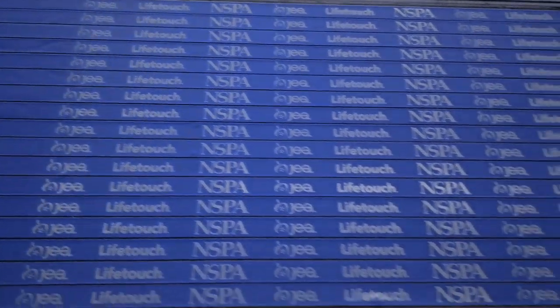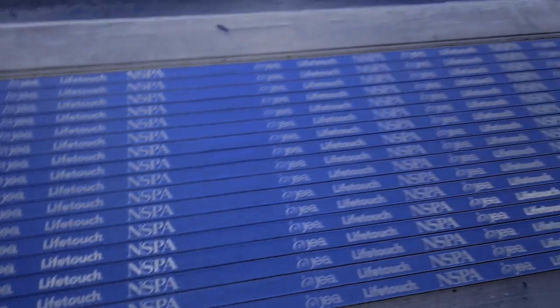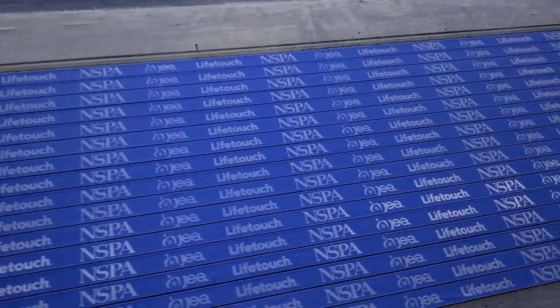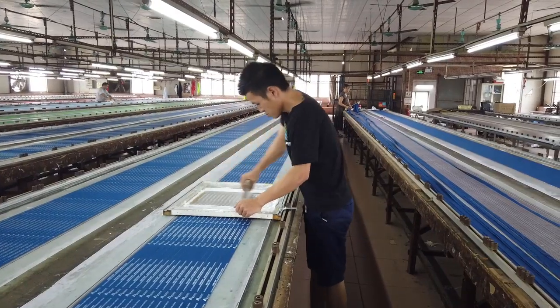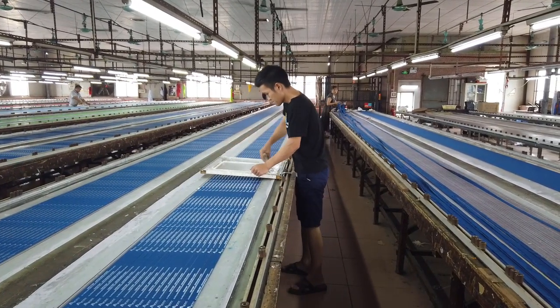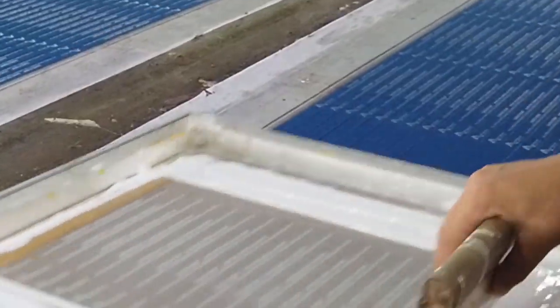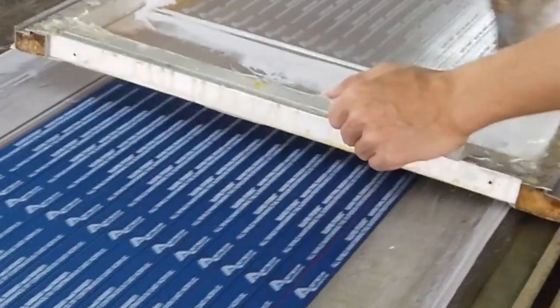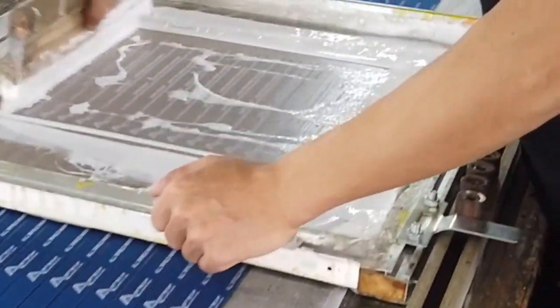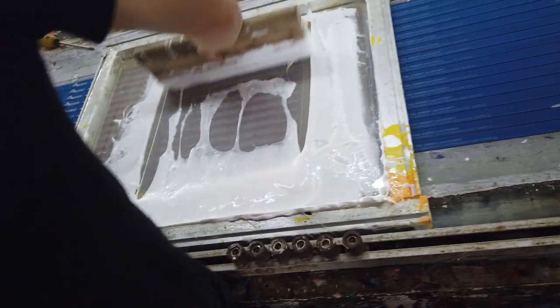Once they are straight and organized, a clear coat is screen printed onto the lanyards in the same shape as the logo to create a smooth printing surface. Then they will screen print the logo 4 to 5 times with light coats of ink. By laying less ink and more passes, they can get much better detail. They typically do 17 up for these 3/4 inch wide lanyards, but that changes depending on the width of the lanyards being printed. Take a look at the silkscreen frame.